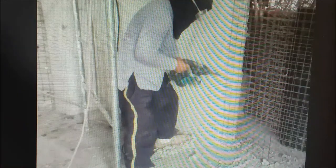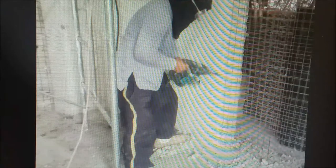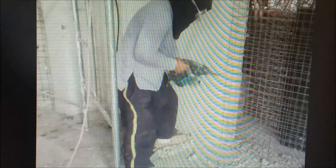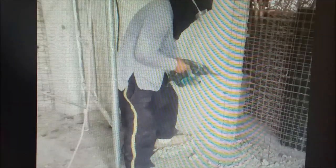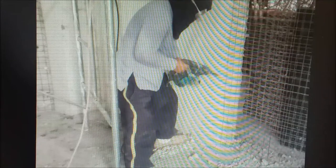What he's doing right now is chipping render back to the door jamb. When you render, you have to go past where it ends, otherwise the edge is ragged. He's got a Makita hammer drill — it drills, hammers, sets rivets — with a three-quarter-inch wide chisel blade. It's an SDS type with an odd-shaped driving bit that has a ball bearing riding down the side to keep things from rotating. Bits are very fast to change — just pull the chuck forward and it falls out.